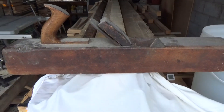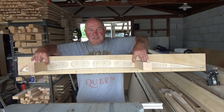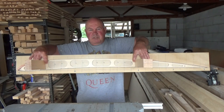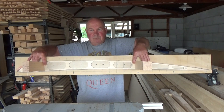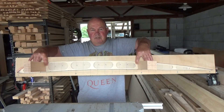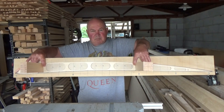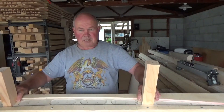This looks awkward — it is — but we're getting towards finishing off the ribs. We've got the three pieces pretty much done; I've just got to sort out the lightning holes for the trailing edge rib and that'll be those sorted. I've got spar mockups done for front and rear. I've just got to find or create a nose rib and a trailing edge piece. After that I think we're on to looking at capping strips. I can see the end — it's getting there.